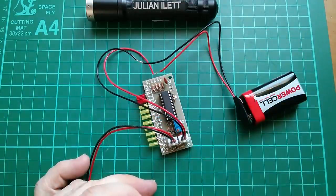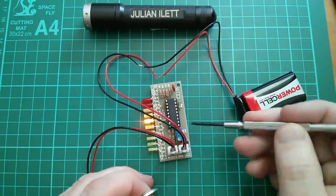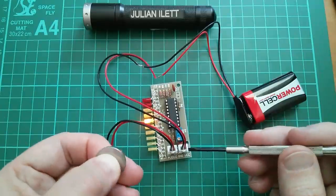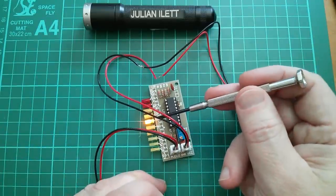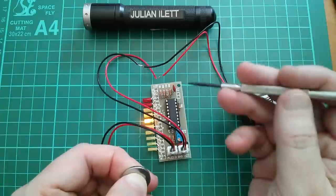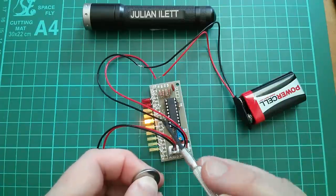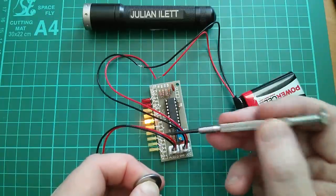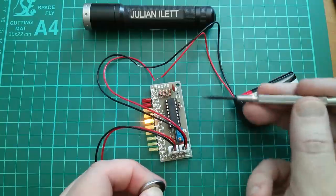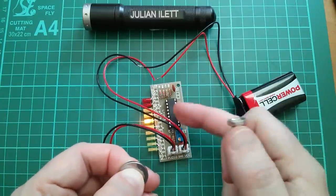There's no DC blocking capacitor at the input — it goes straight through the pot into pin five. When I apply a DC voltage, the LED holds completely stable. For an AC signal, the positive half cycle will cause the LED to blip up, but when it goes to the negative half cycle, the chip is tolerant but won't display it. So this isn't really geared up for an AC waveform or audio as-is.